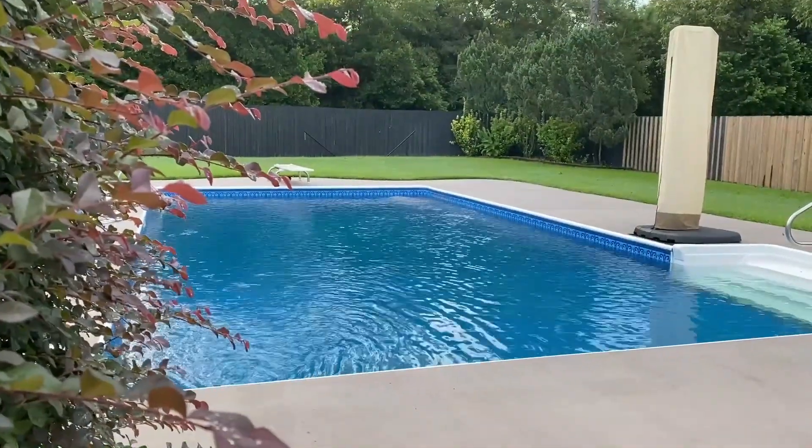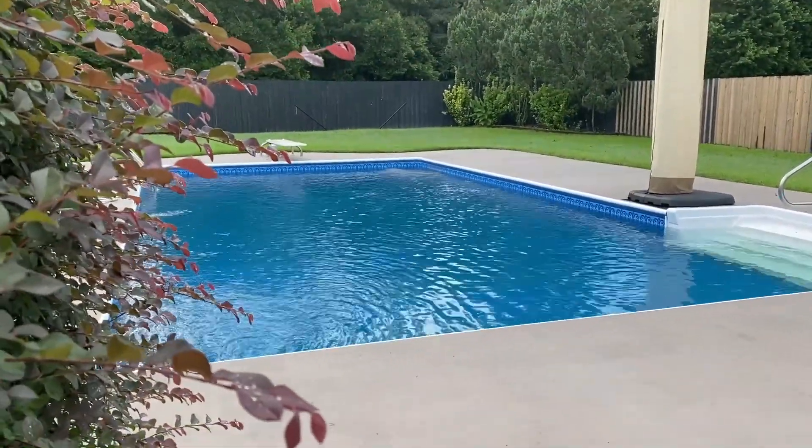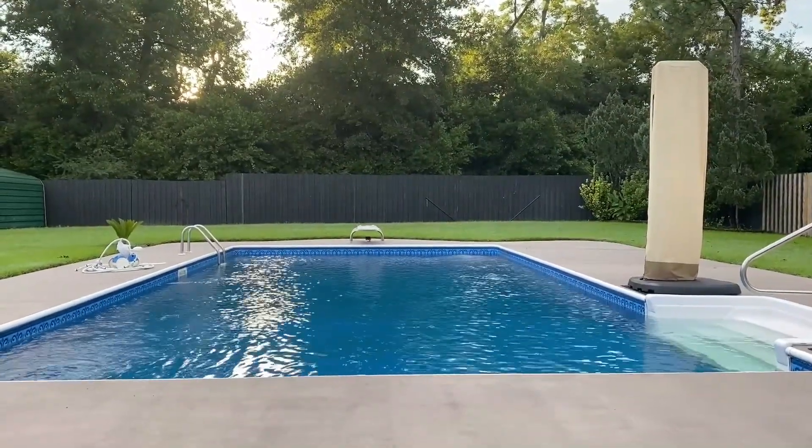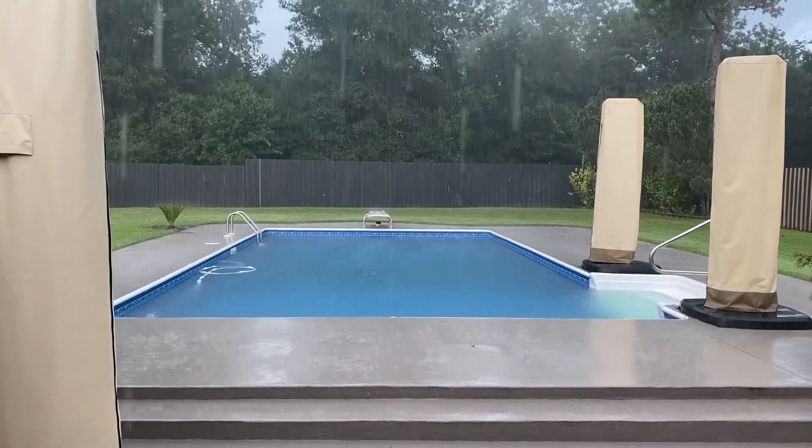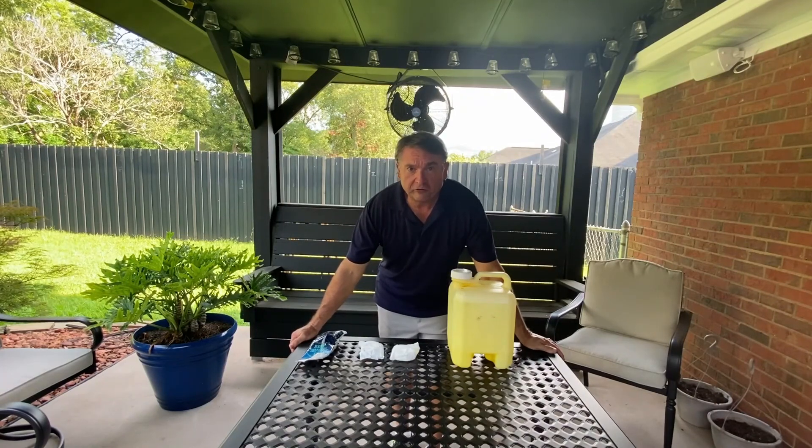The last thing I have left to do on my regular pool maintenance is to shock my pool water. I try to shock my pool water at least once every two weeks, or unless adverse conditions arise. These conditions could be caused by a loud odor of chlorine — this is caused by ammonia joining with chlorine and creating something called chloramines. Or it could be that you've had a large amount of swimmers in your pool and they excreted their bodily fluids — their sweat and yes, urine.